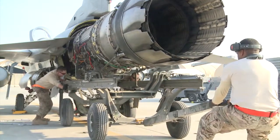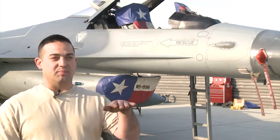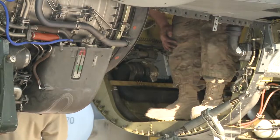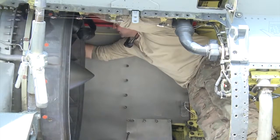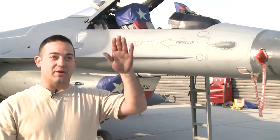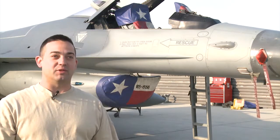When you get towards the very back, because the motor weighs so much and puts such a burden on the airframe, as you start pulling it out, the airframe will settle up. When you get close to the end, right before you come off the aircraft, you want to make sure you're sitting nice and level so that the motor doesn't settle down or up as it comes out of the aircraft, or vice versa with the aircraft jumping up or down when you pull it out.